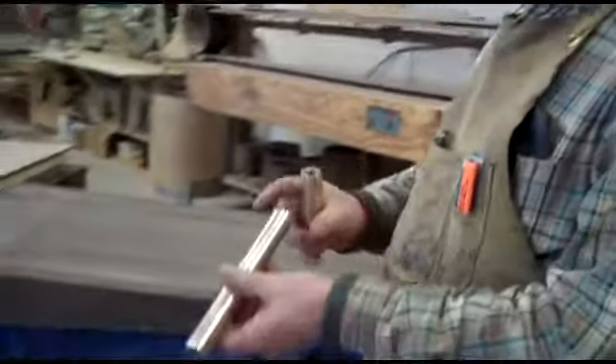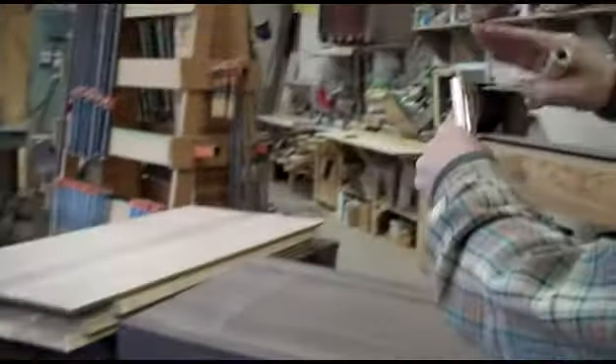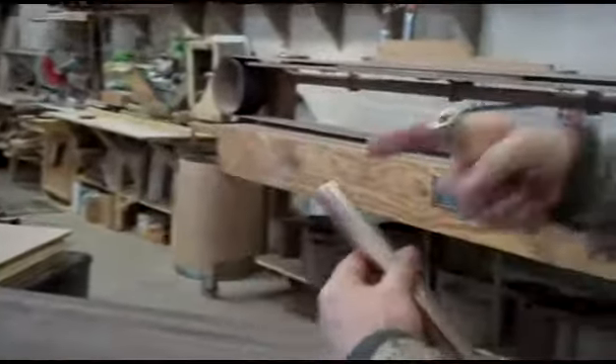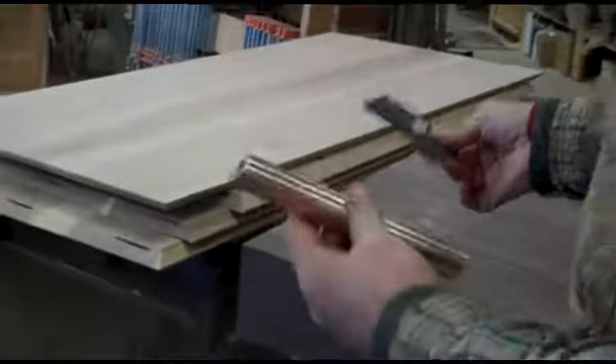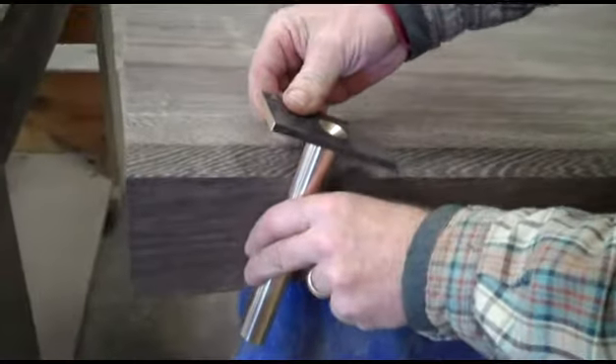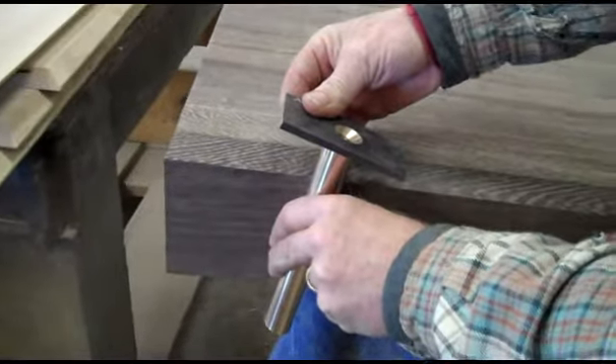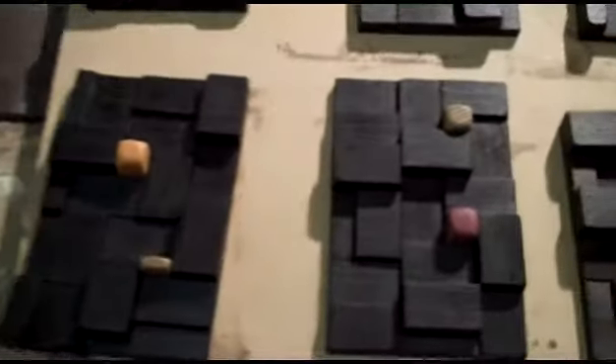What I have are the connection pieces. These are a solid bronze rod and they're tapped on the end, and you can see they're at an angle — this is a different angle than that one. The plate will go on the inside of the carcass piece, and then this rod will go through at the proper angle, and inside the carcass this plate will be recessed, as with the others, and that'll all bolt together. The hardware on these will be such that when you push on the push plate, the door unlatches and then actually opens up completely.